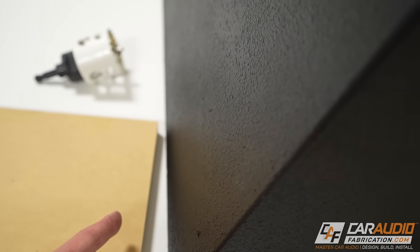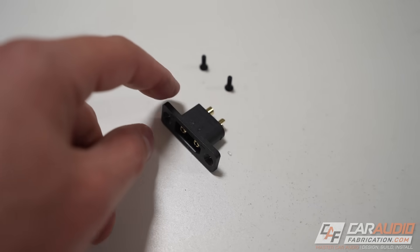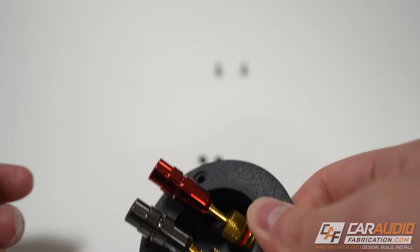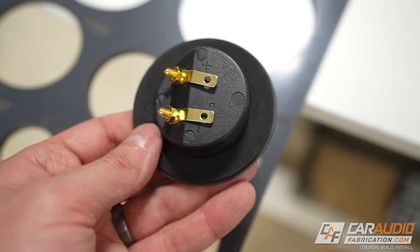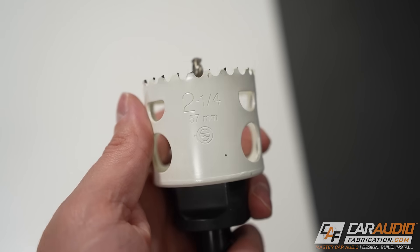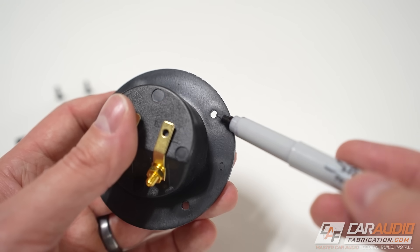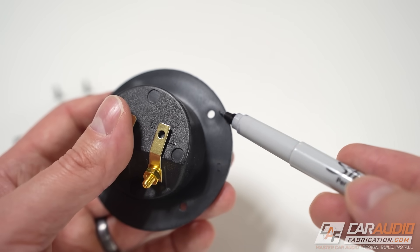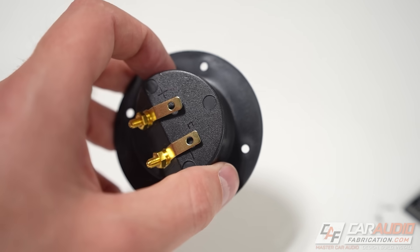So, the first few design goals: I want this to mount at an angle so that it routes the wire more along the side of the box. I also want to quickly make the cutout using a hole saw. I want to use the included hardware that comes with these connectors, and I of course want it to be a plug style connection. It also seems like if you use an inch-style cutout there's always some slop in the fitment, so I'd like to avoid that and fit a commonly available hole saw size. I also dislike how close the mounting holes are to the cutout hole in the terminal, as this often results in blowout on the side of the cutout — so I'd like to increase that distance.